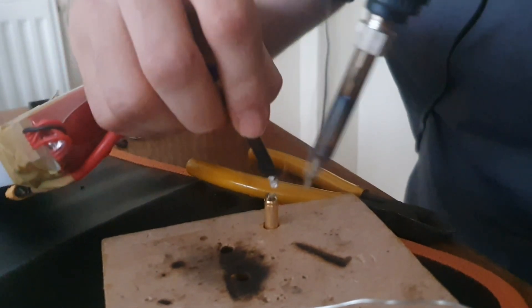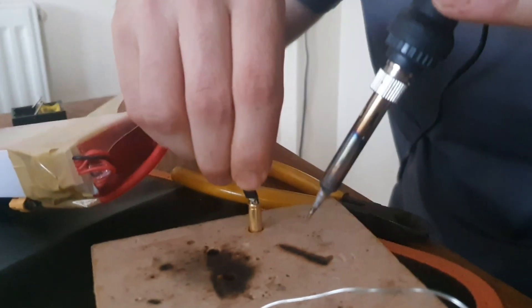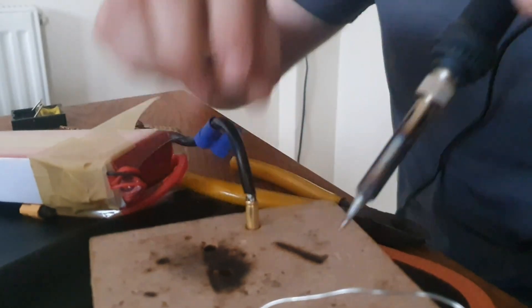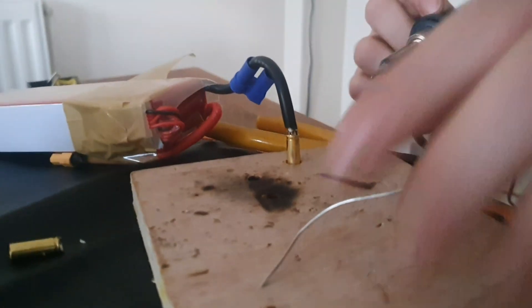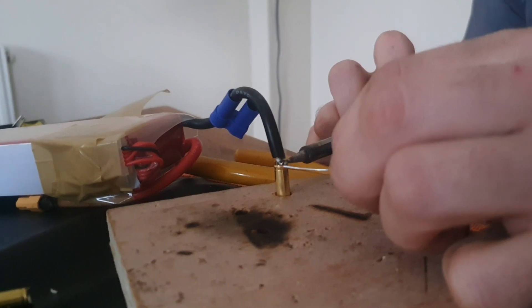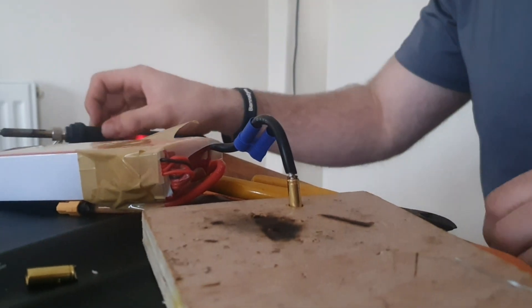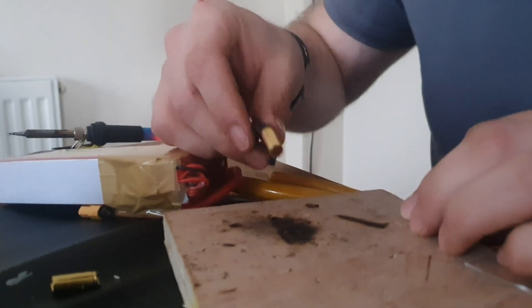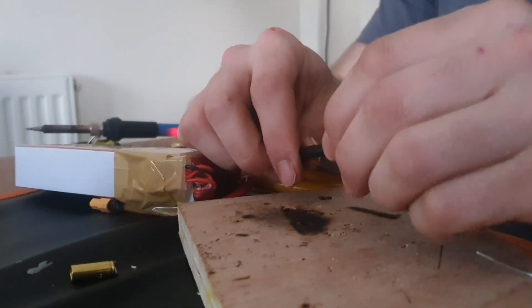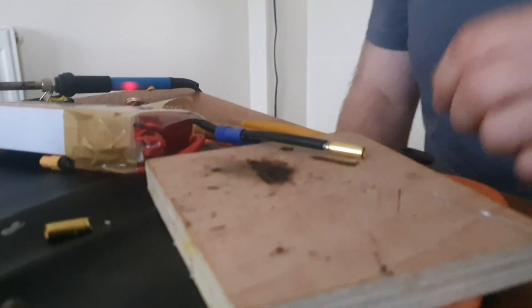When you've got it all red hot, get your tinned wire end in. I've got it hot enough - it seems to have taken. Then if you need to, you can fill in a little bit around the edges just to fill it up. Try not to get solder on that spine. It seems to have taken nicely. If you want to fill the edges in you can, but as it stands it's on pretty well - it's not going anywhere.